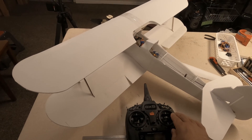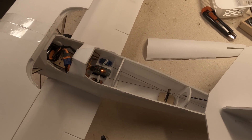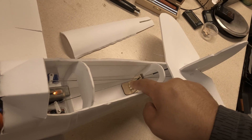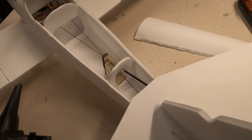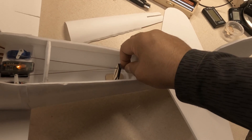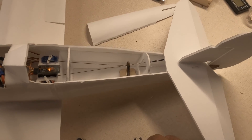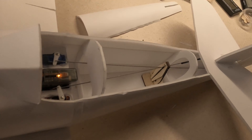There are the ailerons, and here is the rudder movement — you can see the push rods. I put them through this wooden mount design: the front has a vertical slot and the backside has two horizontal slots. When I screw those pieces together, the wires are trapped in there pretty well but it's also easy to assemble. Using the rudder and elevator, you can see pretty much no flex. It doesn't add a lot of mass and I'm pretty happy with how that came out.